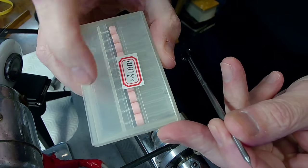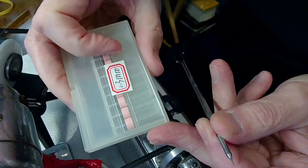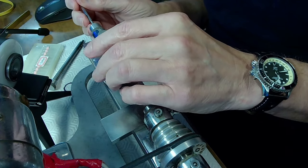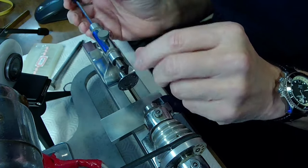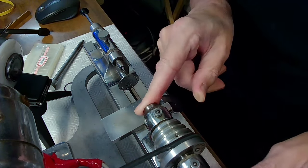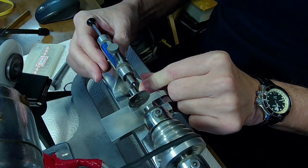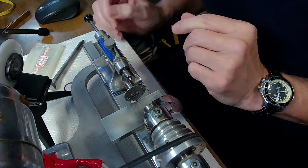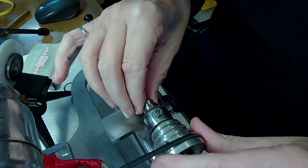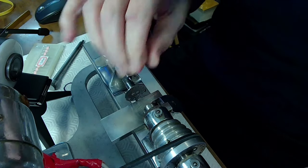I take the pink plastic protector off, put it in the rougher lathe downstairs, and use a Dremel tool to taper it. Then this goes in the end of the drawbar like that, sticks out, and when I put the part in it has to be perfectly aligned with this so when I move the drawbar forward it's perfectly aligned for drilling. When it spins, the part cannot move — period. I select one of the collets and spin it around until it finds home, then the collet is in place.